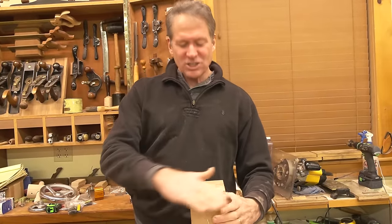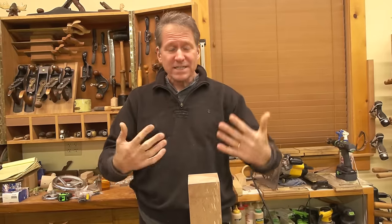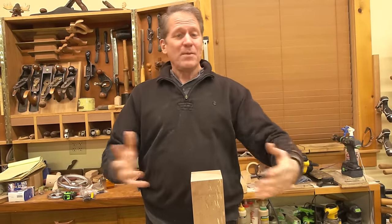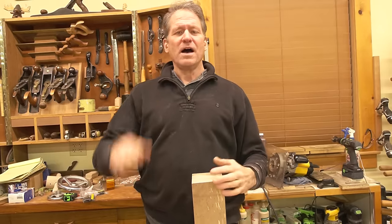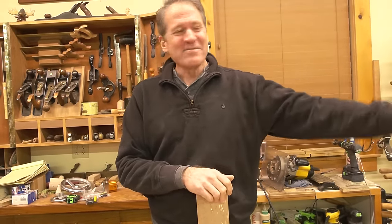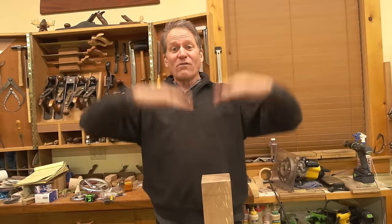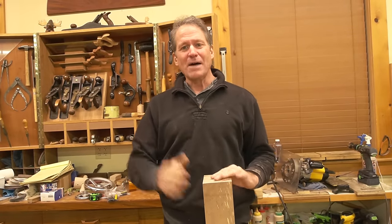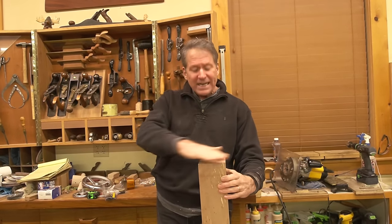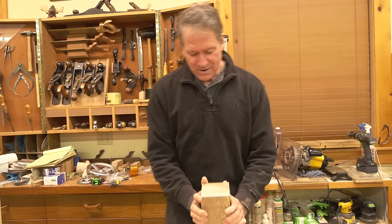I got to thinking: how am I going to square up these ends? I've struggled with this on my own saws. Sometimes your table saw cross cut will only go three inches high, and with your sled you're losing whatever thickness the sled is. With the chop saw, mine was always a little inaccurate. The Festool Kapex can actually cut a pretty straight line, and the Felder too. I do not struggle cutting square in both directions over four inches in height anymore, but for the longest time with just the Powermatic and my DeWalt chop saw, it wasn't as easy.